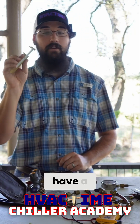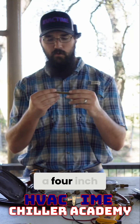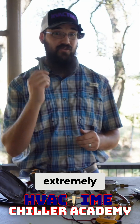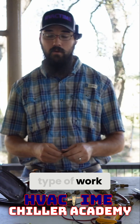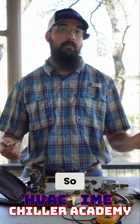If you've done any kind of commercial work, you should have a caliper of some kind. I carry this — it's a four-inch Empire caliper that you can buy at Home Depot. Very cheap, extremely effective tool when you're trying to do shaft size testing and stuff on a lot of heavy commercial type work. These are fantastic.